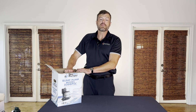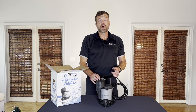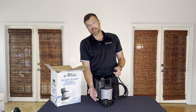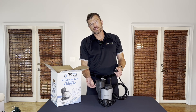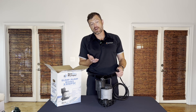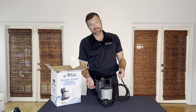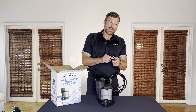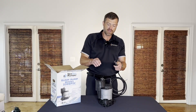Next up is a pressure switch. With the pressure switch, water rises in the basin and air is captured inside of the switch. Pressure builds up, and the diaphragm inside pushes up, activating the switch. As water is pumped out, the pressure drops and the diaphragm disengages the pump. Inside the switch you will see a little tube — this air hose allows pressure regulation for the unit.